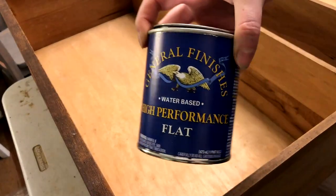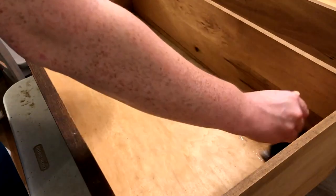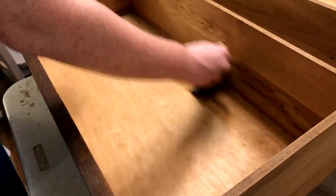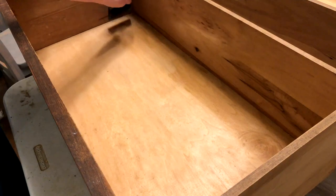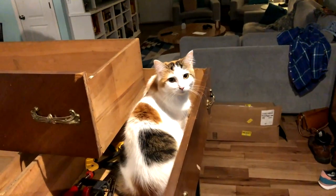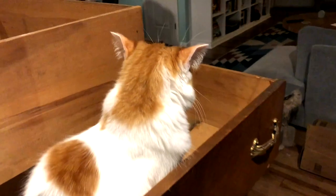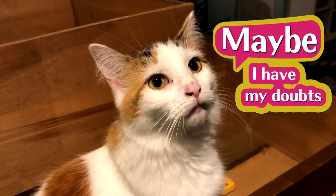I don't know if those labels were originally put on there when whoever made this made it back in the 30s or 40s, or if it was put on during a move, but there's some neat little history going on with this dresser. I decided to seal the insides of all the drawers with this high performance polyurethane in flat. Typically I wouldn't need to do this, but since this piece is a little bit older it had just a hint of a smell to it. I tried spraying it with some vinegar and water and that got out the majority of it, but I didn't want any scent seeping into my client's clothes, so I sealed everything up and it took away the smell entirely. My trusty assistant is always here to help — what do you think, Ripley? Do you think we can fix it?